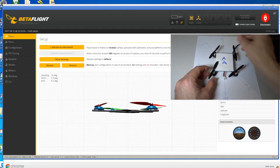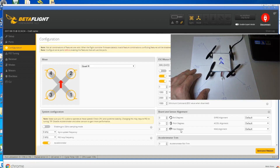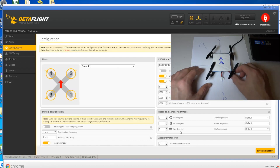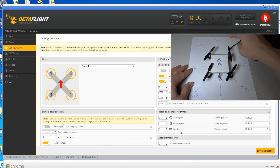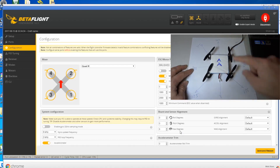I'm going to put this piece of paper on top so it's much easier to see. With the Betaflight configurator, when you change the direction of the board you need to go to configuration and change your degrees. The numbers that you put in are like this: if you look at this paper, you have pointing forward, then you have 45 degrees, 90, 135, 180, 225, 270, 315, 360.